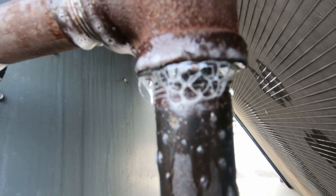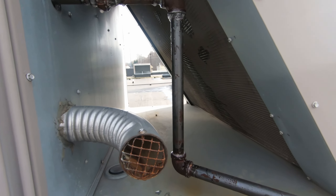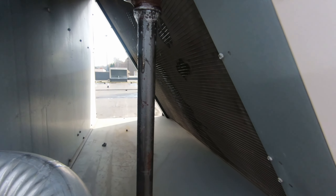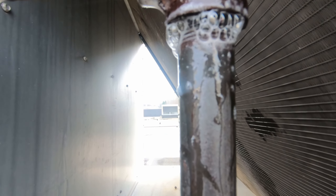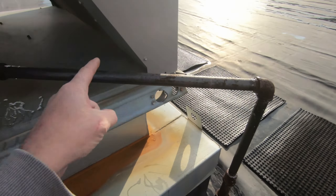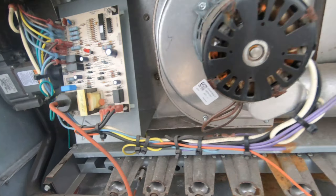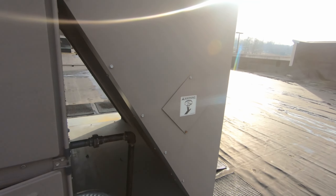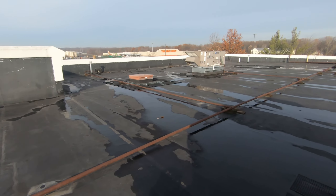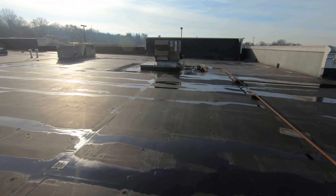There he is — you see him? That's a gas leak, a little guy but still. Somebody's got a good sense of smell — I never would have smelled it. I've got everything but pipe wrenches up here, so I'm heading back down to the van. I did all the fittings all the way up and all the way in to the gas valve and that's the only one that's leaking. Maybe it was when they installed it — who knows. So easy money, easy money.